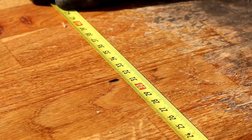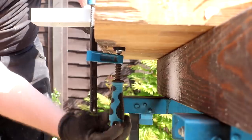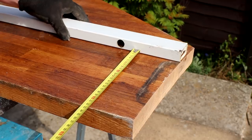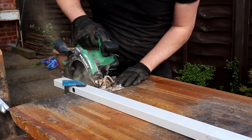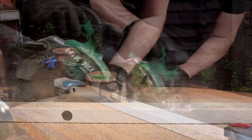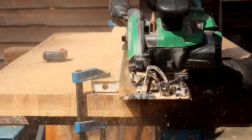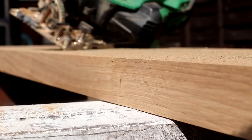I started by marking up where I wanted to make a rip cut through the oak. I bought a track saw recently but I'm not going to be using that — instead I can get great results with my circular saw using a straight edge and a couple of clamps and some careful measuring. This 36 volt Hikoki saw has all the power of a corded saw; in fact I think a lot of corded saws would struggle cutting through 40 millimeter thick solid oak, but the thin kerf blade in this saw coupled with the 36 volts of power got through it no problem.